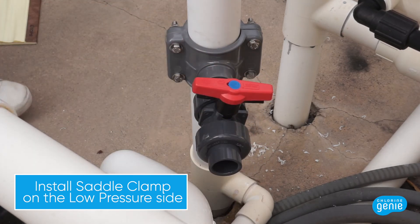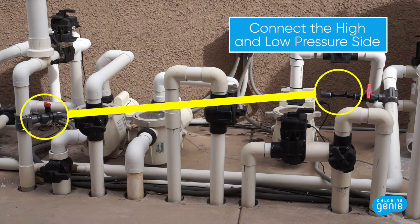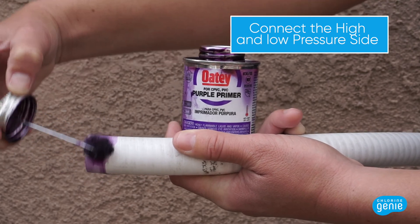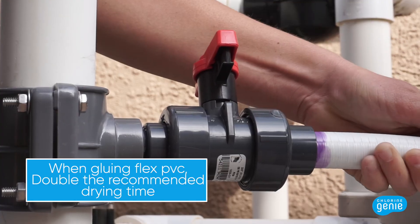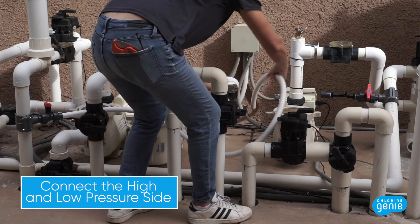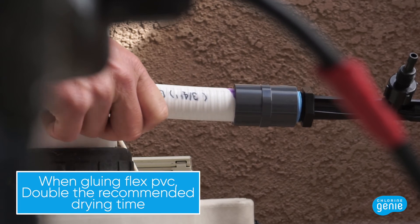Now we are ready to connect the low and high pressure sides. Locate the 3/4 inch PVC flex pipe and ensure the path of the flex pipe can run in a straight path from low pressure to high pressure. Secure the flex pipe with zip ties to existing pipes to prevent sagging and reduce weight on the Venturi. Use PVC primer and PVC glue to prime and glue both ends of the 3/4 inch PVC flex pipe. Insert one end of the flex pipe into the low pressure side at the 3/4 inch isolation ball valve and follow recommended dry time on glue instructions. Route the other end of the flex PVC to the high pressure side of the Venturi. Cut off any excessive flex PVC and insert into the fitting at the Venturi, again following recommended dry time on glue instructions.